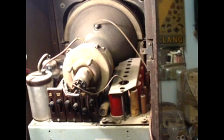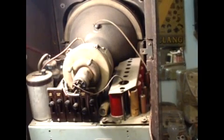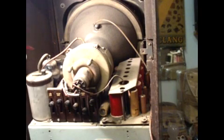On the left you've got the line output transformer — a very simple device because it's not flyback high EHT, it's just a normal line output stage, a bit like an audio output stage really. The frame output stage is behind it, along with the frame oscillator and line oscillator valves. The frame output stage is rather similar to the line output stage, but that scans the screen vertically, while the horizontal output stage — the line output stage — obviously scans it horizontally.